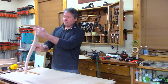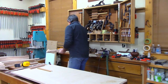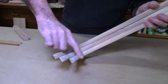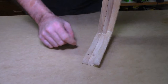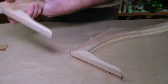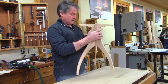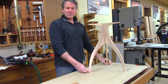Once I round these over and soften the edges, I assemble the table. These three legs have already been radiused. Up in the miter area I did a little bit of filing and used a spokeshave to flatten it out — I didn't want the round-over going into where the pre-drilled screw holes are for attaching the top. Now let's throw all three legs onto the column. They can go in anywhere. There we go — our contemporary looking table base.